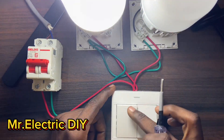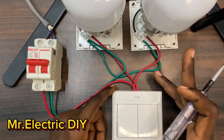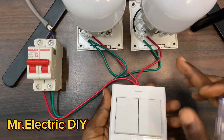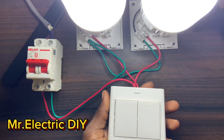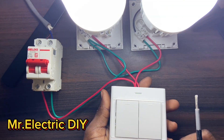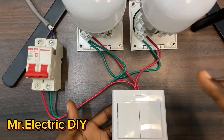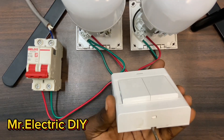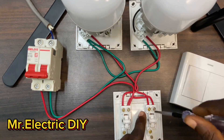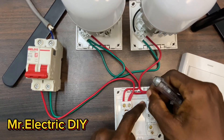As I said, we can actually use L2 and it is going to work. Right now I connected the switch wires to L1. This is the switching position. If I change — I will remove from L1 and connect it to L2 — this side is then going to turn on this lamp. So I'm going to remove the cable from one side of the switch and connect it to L2. This is the switch wire for this side — I'll remove it and connect it to L2.